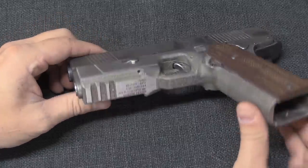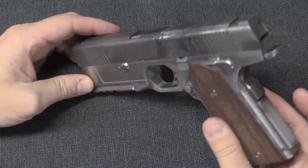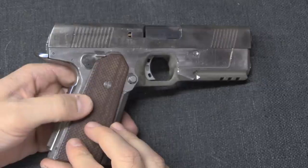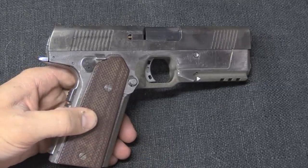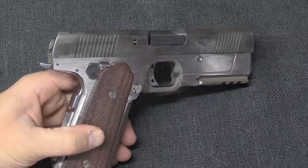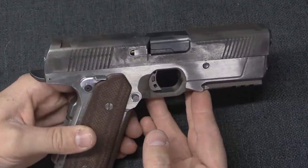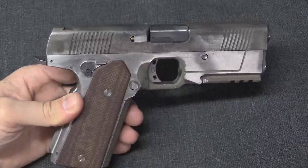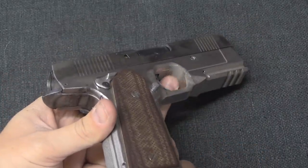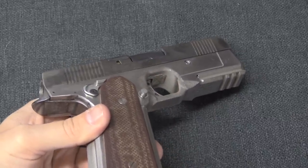I don't recommend that for people if they're trying to start out. It was a very porous material - they hadn't quite dialed in their vacuum sealing or anything like that. But it did mean you could iterate in the space of two to three weeks. Whenever you're dialing in tolerances and trying to have less friction in a mechanical operating system, that was very difficult. So much friction. You can see the finished machined parts and then spaces like the inside of the trigger guard which are really rough - it really does look and feel like a rough casting.